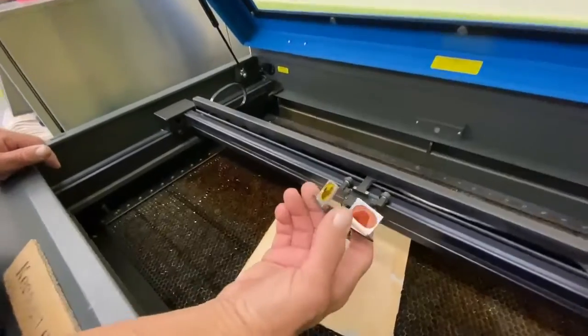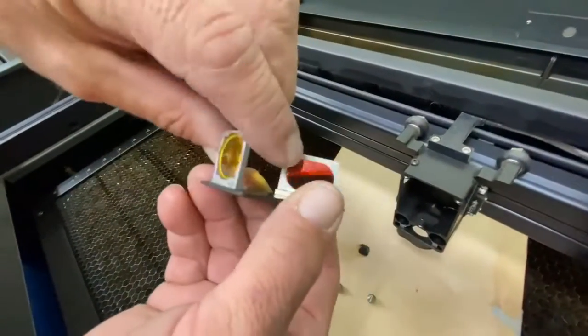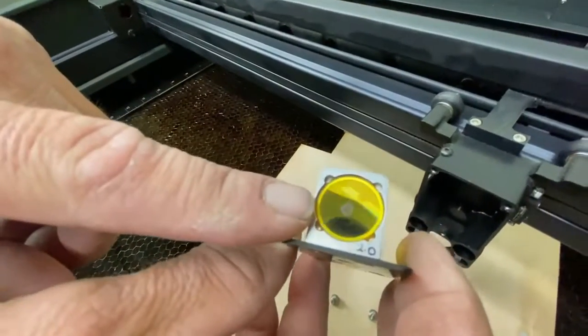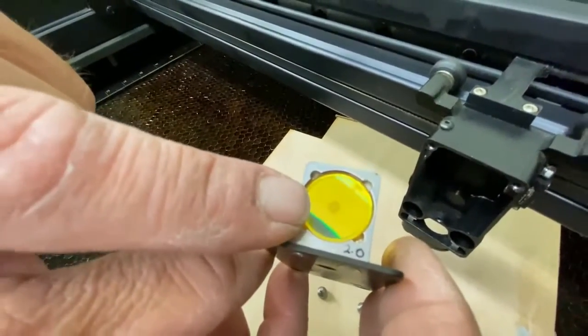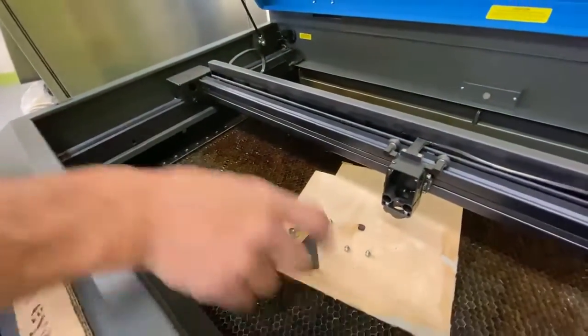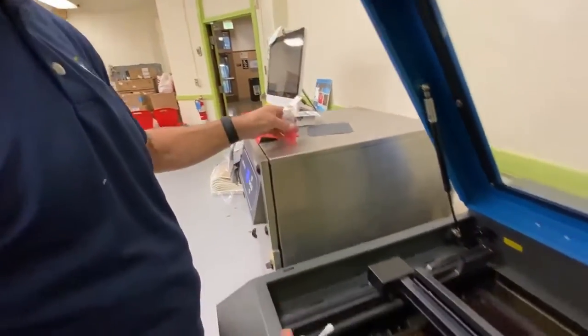You slide this out and hold it by the edges. We've got the two optical elements here — the number three mirror and the objective lens. This lens has a little bit of damage to it. You can see there's kind of a dark spot in the center. When cleaning it, that is actually damage on the lens because it's not going to come off from the cleaner.